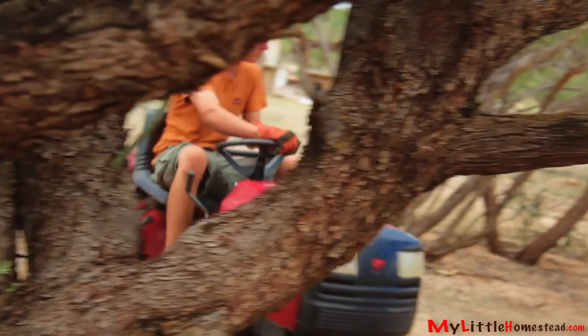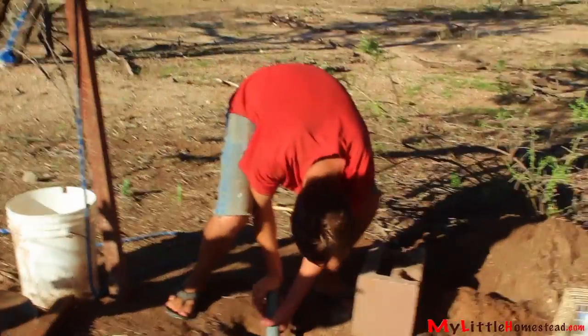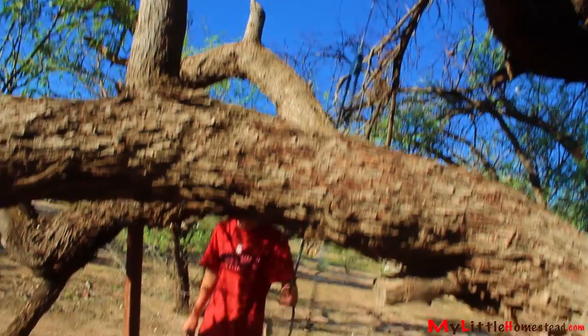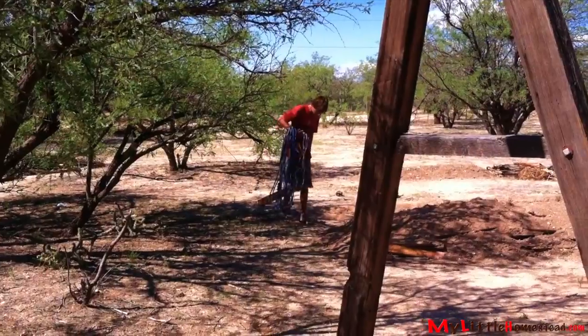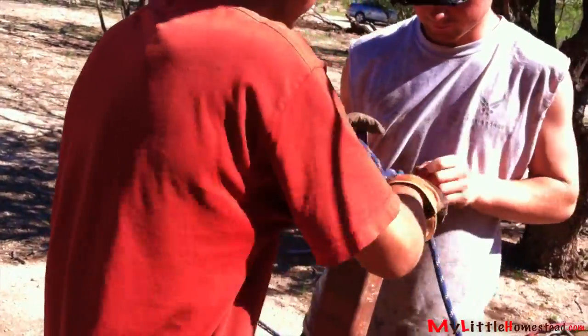Now it's time to get tough. Bryson stumbles into another type of drill and he's ready to get going again. This is my test of a percussion drill — you take a really heavy pipe and you drop it. It's got a one-way valve in it, and it collects dirt and crushes up the earth down below, collecting it up into its cylinder. Then you pull it up, dump it out, and continue drilling down.